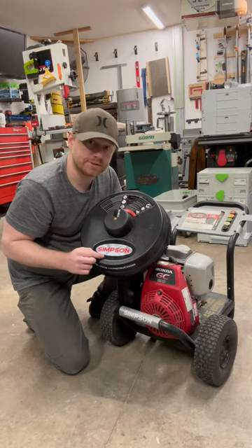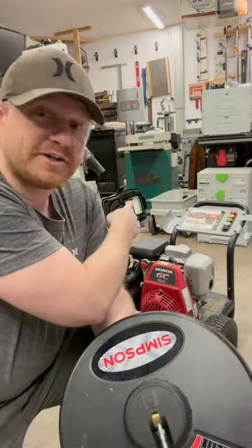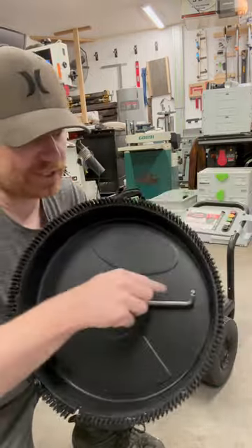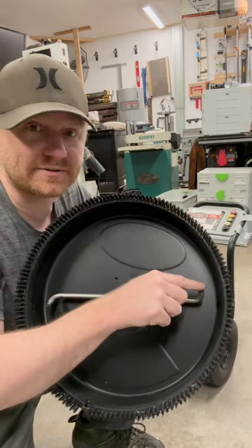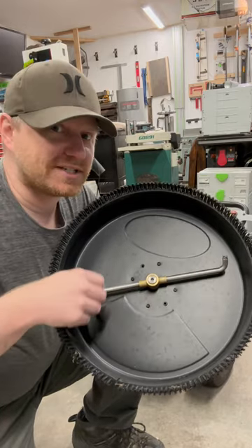This thing is absolutely garbage. This part right here — 3700 max PSI — that's baloney. That's a 3100 PSI model. What happens when you're using this thing is the force that's created between the concrete and the spray nozzle pushes on these arms and bends them and turns them.